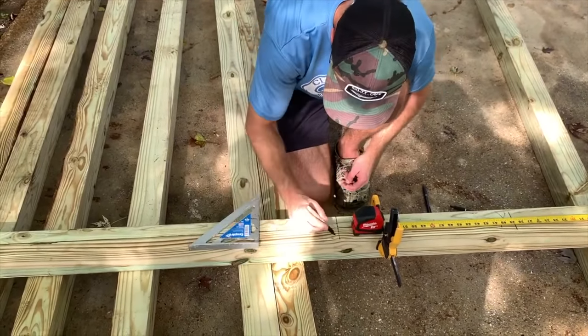Here I am filling in the final two partial cuts and securing it with 1.5 inch screws into the floor joist below. Another helpful tip is you can use a chalk line to mark the joist location. That way, if you miss any of the 1.5 inch screws to secure the plywood to the floor joist below, you can go back later and make sure that all of your screws are going to actually contact a floor joist. And at this point, your shed base frame is complete.